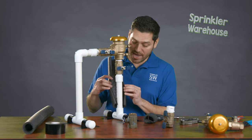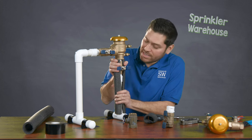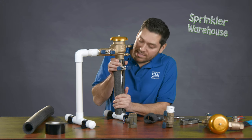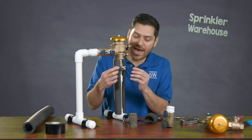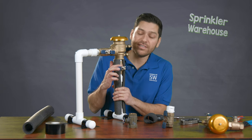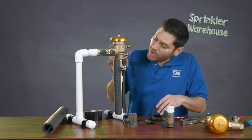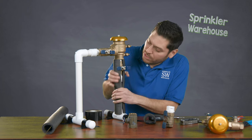You can make the measurements and cuts using the insulation. We're going to insulate all the way up to where the PVB starts, so we have the valve insulated and the PVC pipe insulated as well. Our knob is in its position here — sometimes these knobs will rust out and go bad. We also have a kit where you can buy these valves in stainless steel at Sprinkler Warehouse, so you wouldn't have to worry about rust. Once you have the insulation pre-cut and trimmed, go ahead and get some tape. It's closed pretty well when you tighten it up.